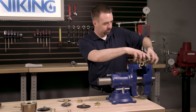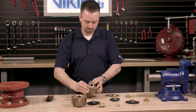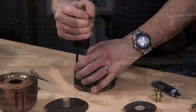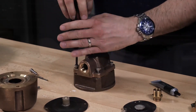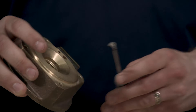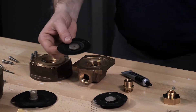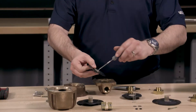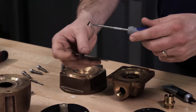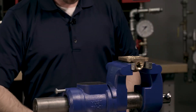To remove the additional parts, the accelerator will need to be turned over so that the base is in the upright position. Remove the four screws from the base. With the base removed, the screen filter can now be removed. Next, we can remove the clapper diaphragm from the base. Now, remove the U-cup retainer and U-cup from the clapper diaphragm. Remove the seat from the base.